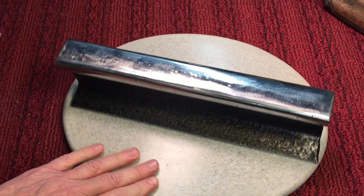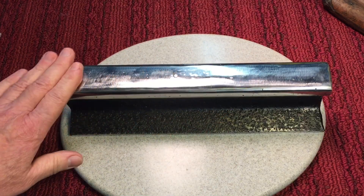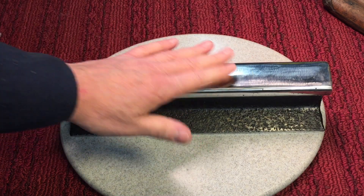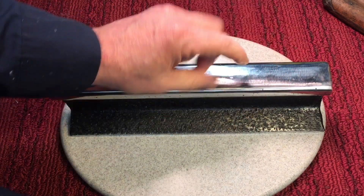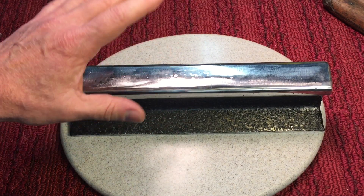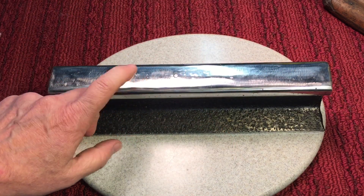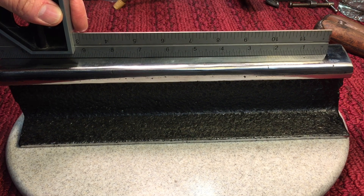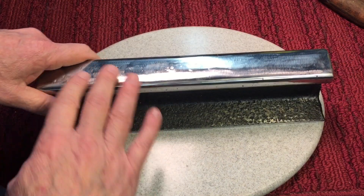This is going to be a great addition to our portable anvils. When you're looking for a portable anvil, first of all you want it as flat as possible, but flatness is secondary to smoothness. You want it to be smooth, because anything you hammer on it will make an imprint. If you have leather or aluminum and your anvil has nicks and gouges, it's going to show up in the material. This one is fairly straight — when you put the square on it, it's good enough for government work — and it's got a nice finish.